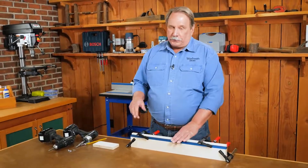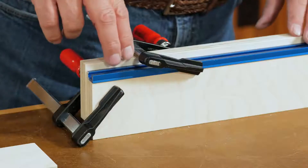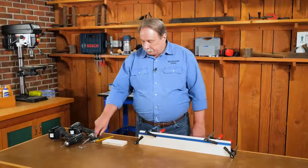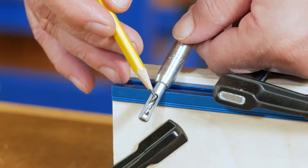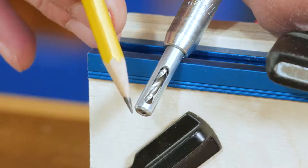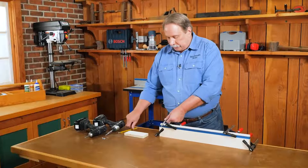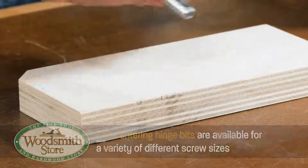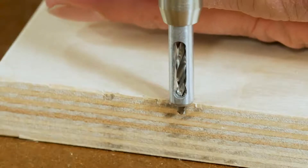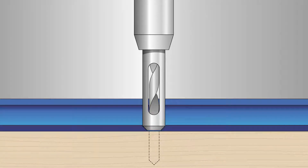Now I'm ready to drill pilot holes with a twist bit, but as you're drilling into almost any wood — particularly plywood like this — that bit tends to wander around a little bit and can really mess up where your pilot hole ends up. To solve that problem, I use what's called a self-centering hinge bit. It has a twist bit as the core, a sleeve around it, and the end of the sleeve is beveled to match the countersink in the bottom of the T-track. The sleeve is also spring-mounted, so when you drill, the twist bit extends beyond the sleeve to drill the hole, but the sleeve and bevel stay exactly in position because of the countersink.